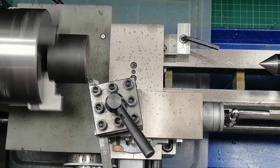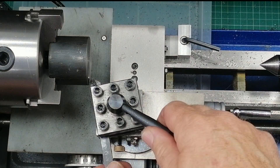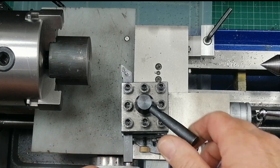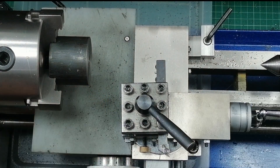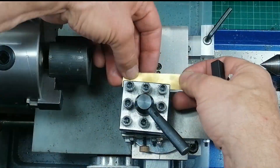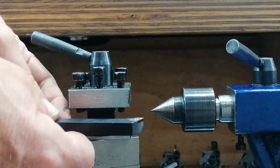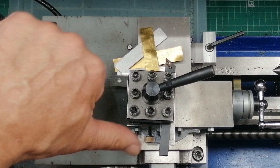The stock four-way is rigid. Cutting forces go straight into the bed — exactly where you want them. But here's the problem: the smallest insert holders I can buy are twice as long as the post itself. One tool sticks out the back and instantly blocks the rest. No matter how I load it, I can't use more than one slot. So my four-way tool post is really just a one-way. Every swap means unbolting the old tool, stacking shims under the new one, and fiddling until the height lines up. It works, but it's slow, clumsy, and painful. I realized the whole point of the four-way was wasted.